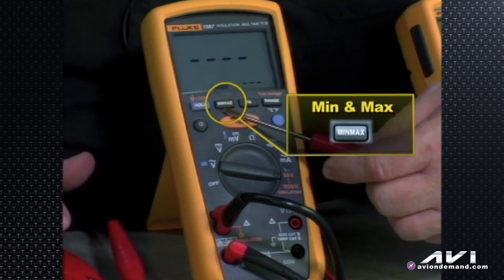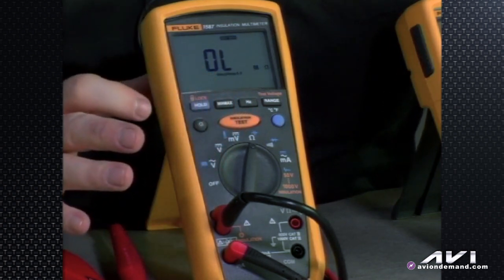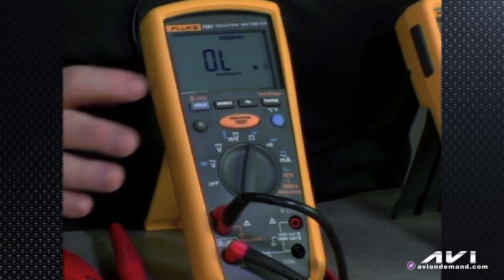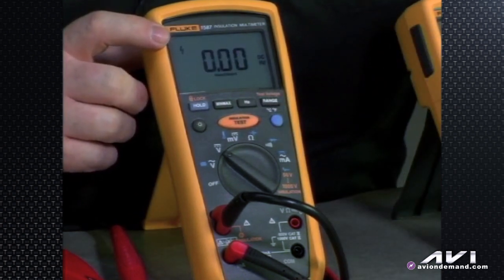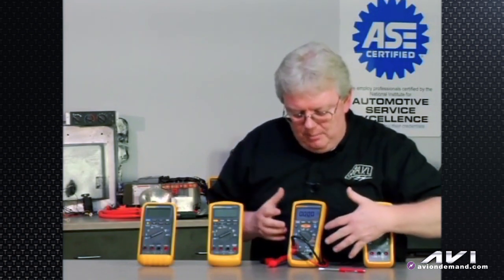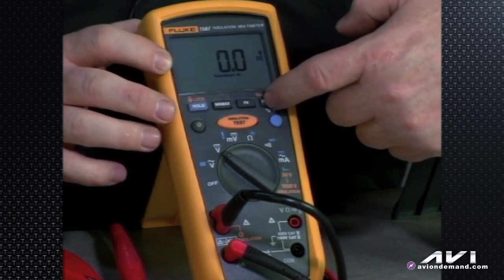Minimum and maximum recording: turn it back to ohms — say you're looking at a TPS — and it records the minimum and maximum of the range, then you can play back and see the average. Turn it to volts: same as other Fluke products, hit the hertz button and you get times-per-second frequency reading; hit it again and it goes back to DC. So it doesn't give you a duty cycle function, not quite as many automotive functions as the Fluke 88, but it can still read frequency. The range button switches from auto range to manual range and back.